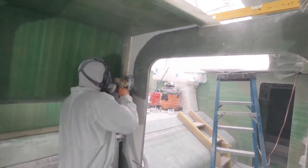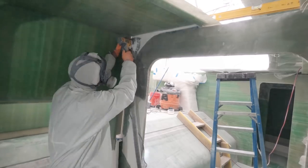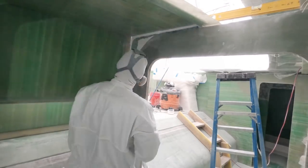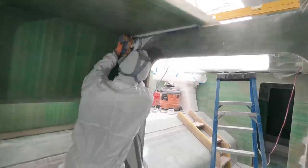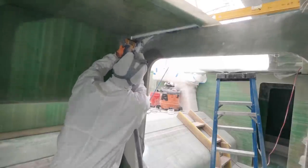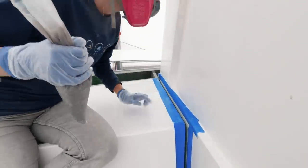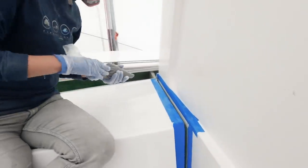After the cockpit seats were bonded into place against the bridge deck of the boat, as well as the transom, we had one spot left to bond them, and that was to bulkhead 6. Matt cleaned off the excess gel coat within our bunk, since it wasn't necessary, and then I went to lay a bead of our methacrylate bonding agent between the seat and the bulkhead.